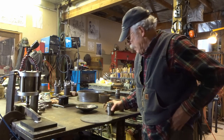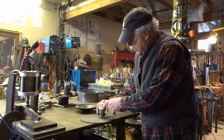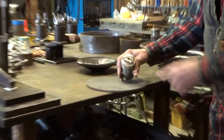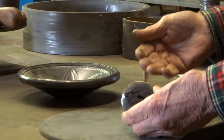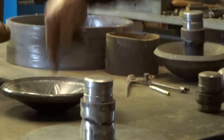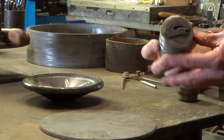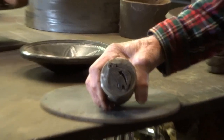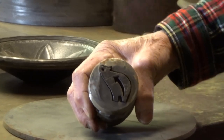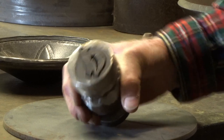This was an experiment and it worked out pretty good. I had Dan Waterjet my little bear — favorite little bear — out of a piece of 4140, and then I took it and pushed it forward and welded it in and put it on a stem. So as it pushes it gives me the rounded flat bottom, but it also imparts the bear into the center. It's just a little Hopi bear — this one the energy is coming from the nadir up towards the heavens, and then they have ones where the energy comes from the heavens down to the earth nadir, as they say.